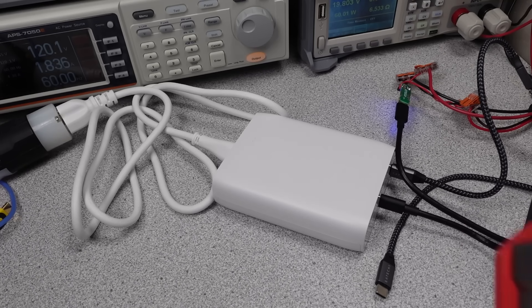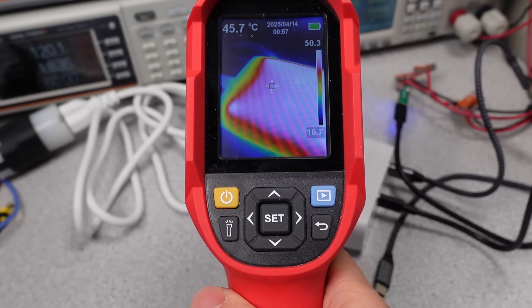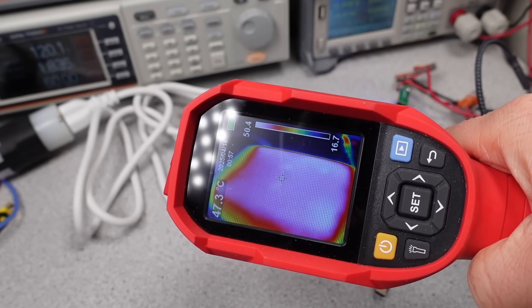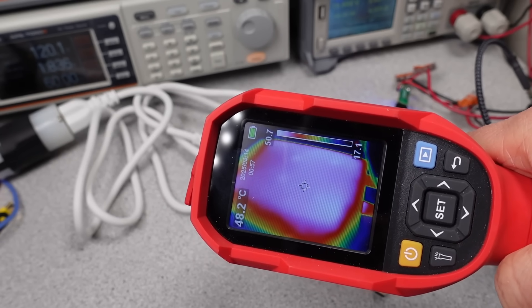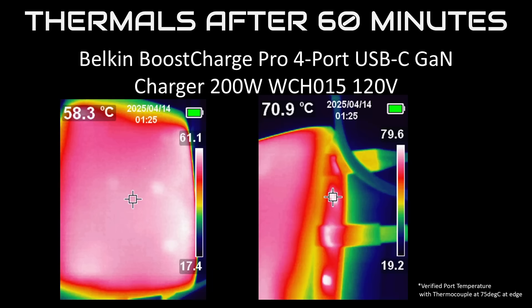Thermally, this adapter was able to stay on without any problems. It's certainly getting hot on the inside, and the case was still getting hotter after the 60-minute period of operation, but it's far from the worst adapter I've seen in this regard. The thermals are tied to the power level and the efficiency of the adapter. In this case, the adapter is pretty strong on the efficiency scale, so it's not too much of a surprise that it stayed on. With roughly 20 watts to deal with at full load, it's not going to be cold by any means, but reasonable. The heat inside could mean shorter life for capacitors — see videos linked in the description for deep dives on this.